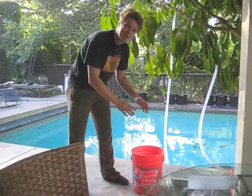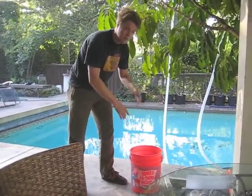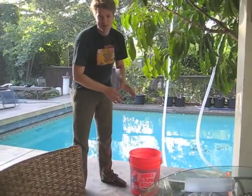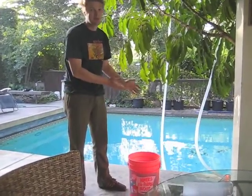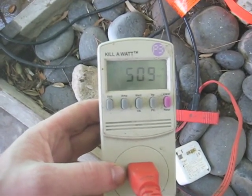So I did the calculations on how much energy we're putting into the pool. At 2 o'clock, which is in peak sun, we were putting in about 11.4 kilowatts, which is pretty warm. But you can get gas heaters that are a lot beefier than that. But this is really cheap. With both pumps going, we're pulling 500 watts.